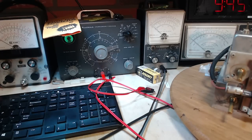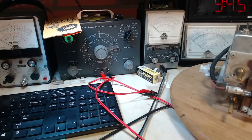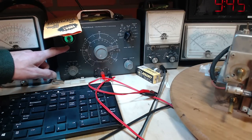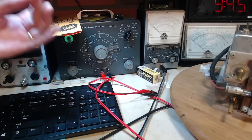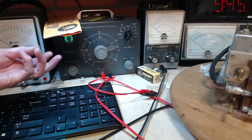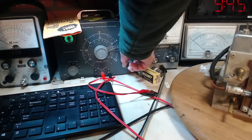Okay, so he's hooked up now. Give him a test at 25. A good capacitor, this eye will snap closed and pop right open again, just like you see it. It takes a moment for the capacitor to charge up. That causes the eye to close, but once it charges, it's open. If there's a leakage, it just won't open all the way. If it's bad, it won't open at all. So here we go, 25 volts, not much voltage.